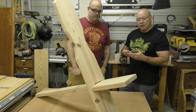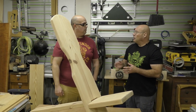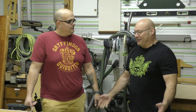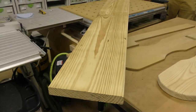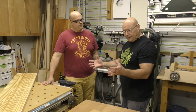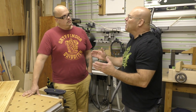It's a fun chair. There was one afternoon I built five of them for a friend. He thought it was taking forever, and I said no — I have a template and it's a 2x12. So let's get started. It's simple: we got a 2x12, which is an inch and a half by 11 and a half, and that's the way we designed this. What I learned early on is instead of trying to do everything on an eight-foot length, let's cut it down to manageable pieces. We need one piece at 45 inches — or about 1160 millimeters.